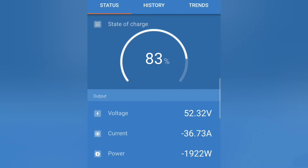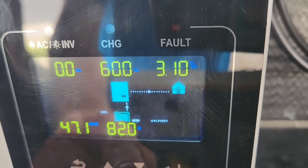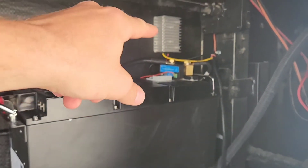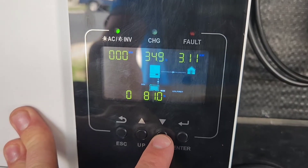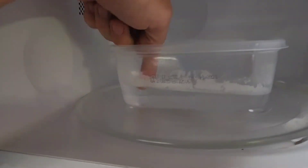The fan should be turning on first. There it goes — it's running the compressor. It started the air conditioner! 3,400 watts coming from the battery. It's at 103 percent capacity right now — it should be shutting down pretty soon, but it's still running. There are some more watts, about 200 watts, coming out of the 12-volt system. The microwave just stopped. The 6,000-watt inrush to start the air conditioner was too fast to see on the Victron smart shunt, and I had a 2,000-watt base load — but it handled it.